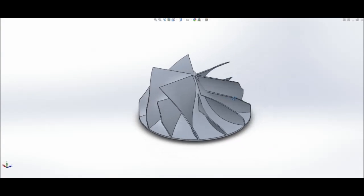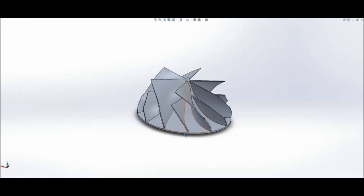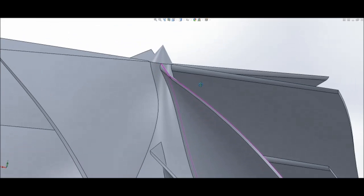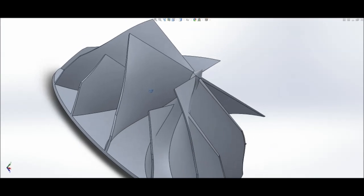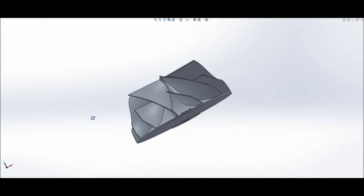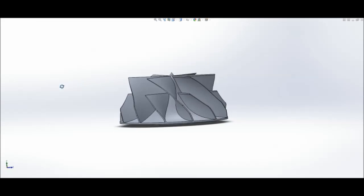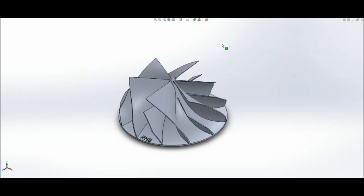Here's a better drawing of a compressor wheel — this one has six plus six blades instead of just 12. To draw this, you do the one blade profile on the top plane and bottom plane, then make another plane in the center and draw another arc on the bottom and another flat spot, then loft that. You can also fillet the edges like I did here to make it look aerodynamic. There are a lot of other cuts you can do — this is just a prototype wheel. If you need any help, comment below. I'm not really a pro at SolidWorks but I learned how to draw compressor wheels on my own and I feel like a lot of people could benefit from this video. Thanks for watching.